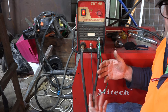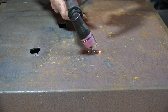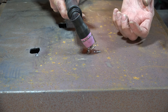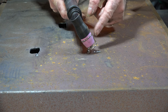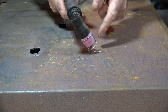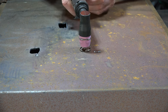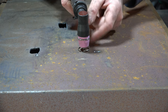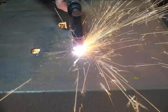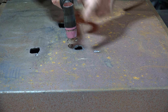So now we've set up the pilot arc torch - let's go and see the difference. We've got our pilot arc torch plugged in. With the pilot arc, pull the trigger and the flame comes out - we don't have to touch the steel. And because we don't have to touch the steel, what we normally want to do is hold the tip off the steel so it doesn't burn through the tip straight away. You'll find with some plasma cutters that you can't touch the tip on the steel because it almost instantly burns them out. So that's basically what the stand-off guide is for.